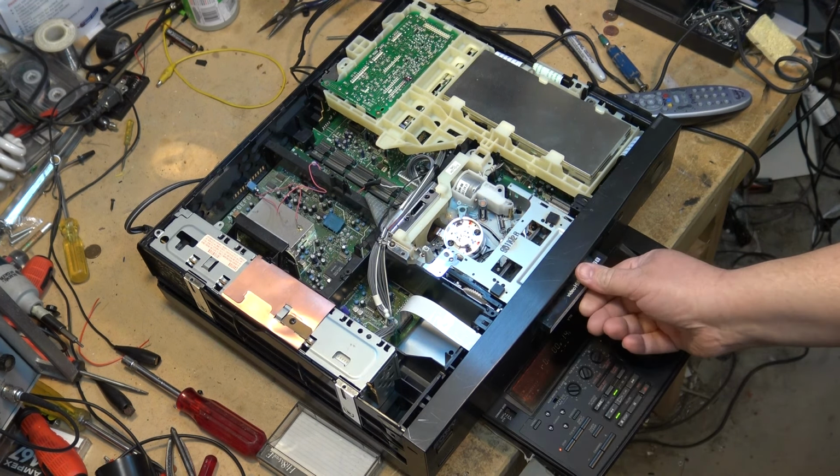The only thing was the EVW300 used the broadcast industrial time code, whereas this machine has time code on it as well, but it used the RC time code standard, rewritable consumer time code. So this machine could not read the time code that was written by an EVW300, but you could take a tape from an EVW300, put it in this machine, and rewrite the time code as RC time code format, and then you could use the machine for frame accurate editing because it had time code on the tape.